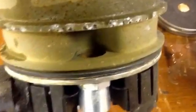You can see there's definitely some pitting going on, and that's all over the place. But I can't see why that would have affected the operation of the boiler. There's still integrity between each one of these sections, so it's not going to try and circulate the wrong way. On this side — here's where I chopped it open — there's no real evidence of any particular issue with this heat exchanger.